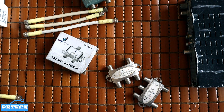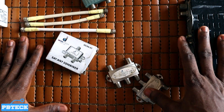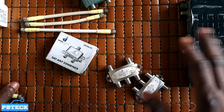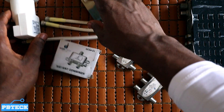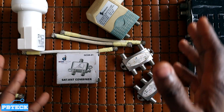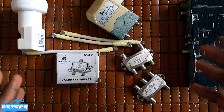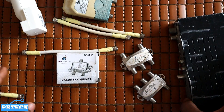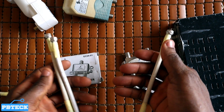Welcome to PB Tech. In this video I'm going to show you how you can connect a DiSEqC onto your FTA decoder. A DiSEqC is simply a tool that will allow you to combine different satellite signals from different cables or different platforms onto your satellite receiver — one satellite receiver. So let's say you have installed multiple dishes with multiple LNBs with a signal coming from different satellites, and you want to get the signal onto one FTA decoder.